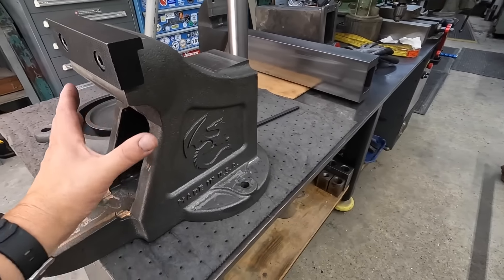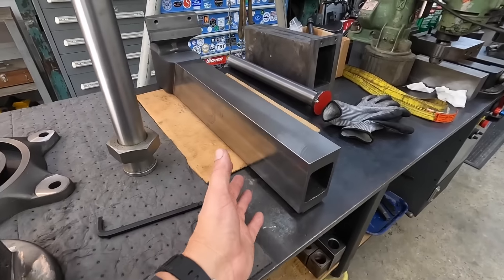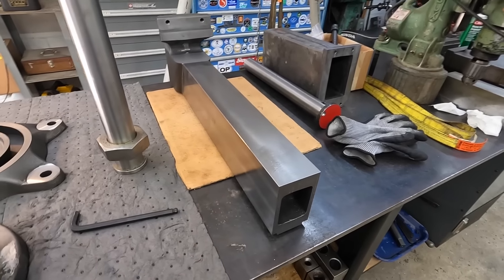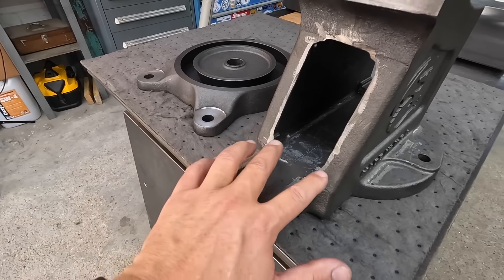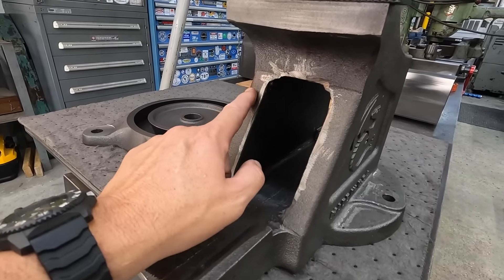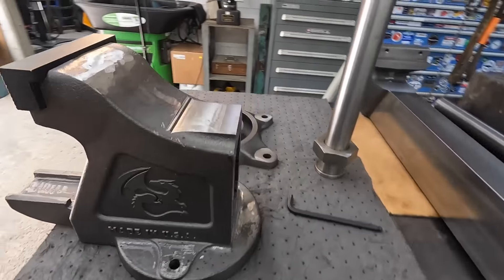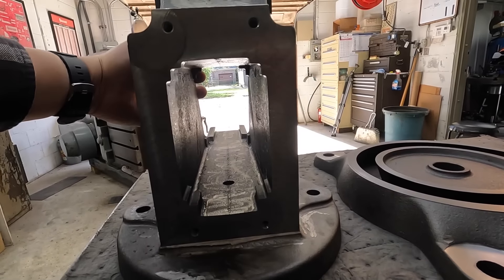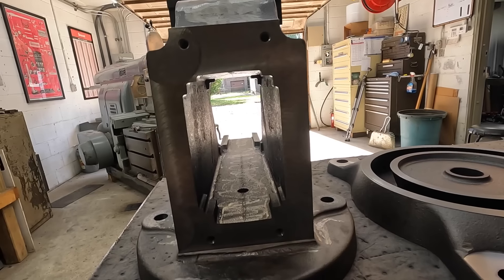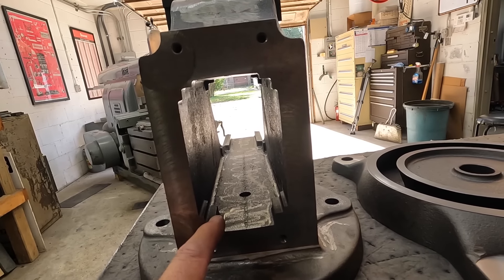This is our piece we're going to be working on - the main vice body. We need to get the inside machined so that it precisely fits our dynamic jaw body. You have the chin portion here that's got to be cut, and on the inside you have the two sides. On the top there's sort of an L-shaped part that was put into the pattern that's got to be cut. Coming around to the back side you can see the top corners - that L-shape - one right here and right here. This bottom surface is going to match the chin.